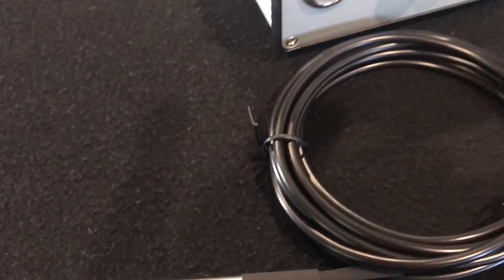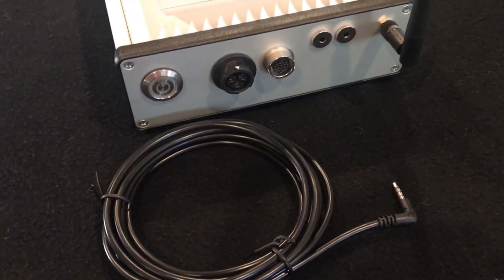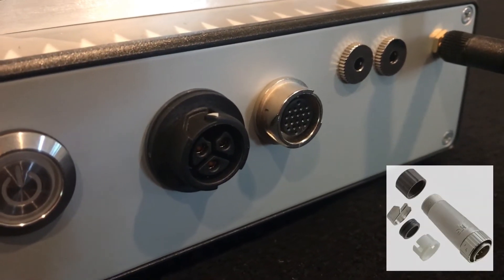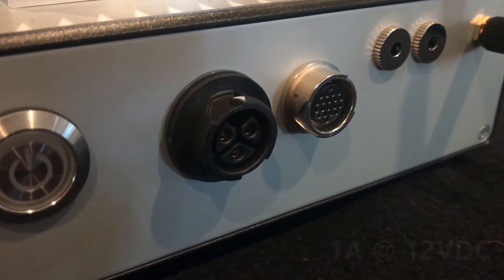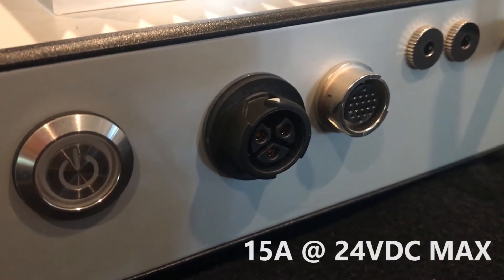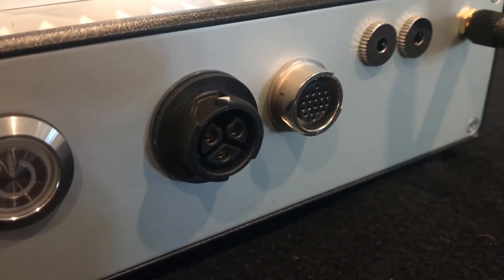The probe can be installed into any vessel or fitting via compression adapters, which are not included. The Uniflex supports up to 10 temperature probes and additional ones can be integrated via off-the-shelf headphone splitters. The Uniflex includes one probe for single vessel and two for dual vessel configurations, but additional probes can be added as needed. Next are connectors for the optional I/O and I/O power — mating connectors are included so you can wire in your I/O at once or in stages. Using the internal power supply, up to one amp at 12 volts DC is available. If you need more power or a different voltage, you can provide up to 24 volts DC and 15 amps via the external power connector, allowing each high current output to drive up to three amps — enough to drive a DC brewing pump directly.